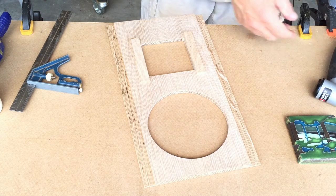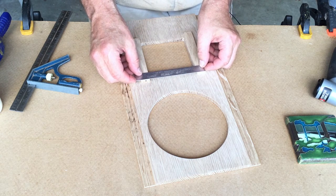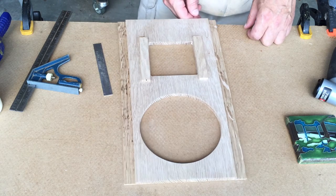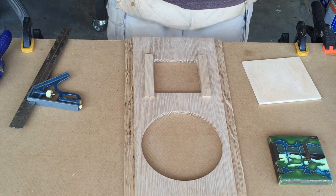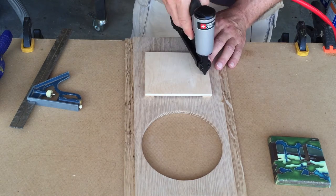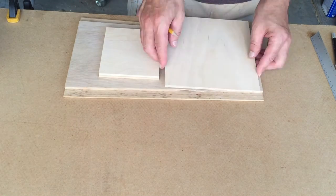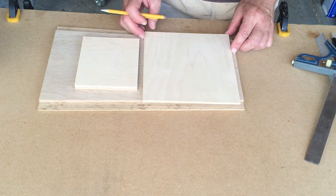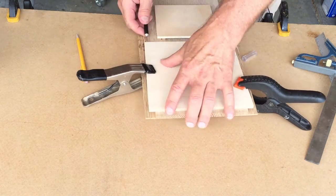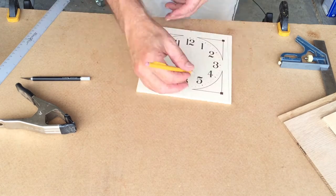Now I can take a measurement for the plywood piece — it's just a little over five-and-nine-sixteenths — and cut it at the table saw. I put a little glue on and fastened it down with some pin nails, and when I turn the piece over and drop the tile in, it comes out exactly where I wanted it to be. To trim the dial, I drew a center line with my combination square and marked the center of the six and twelve. Once those center lines are lined up the clock face is straight up and down, then I just marked the edges with a marking knife and trimmed those extra pieces off.